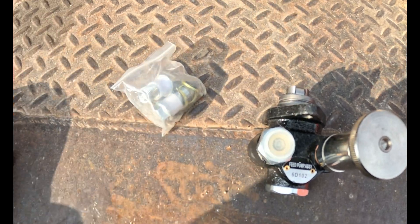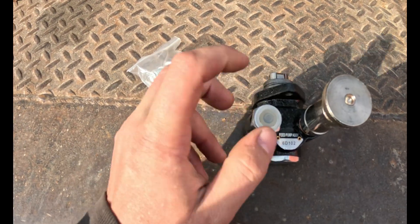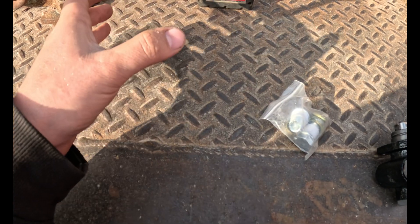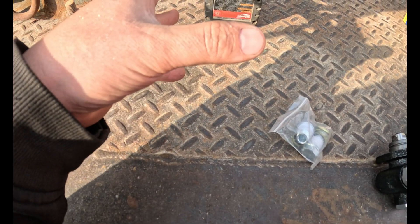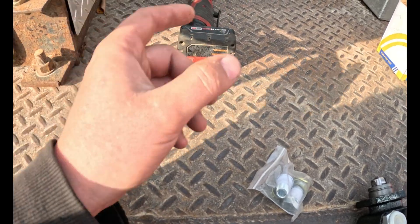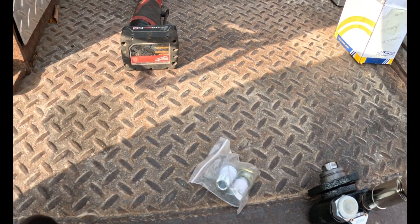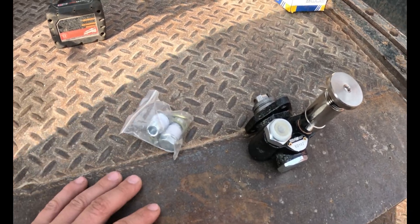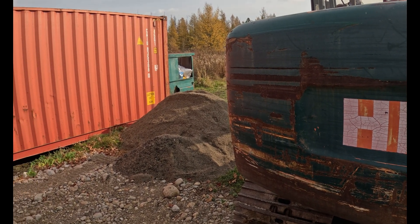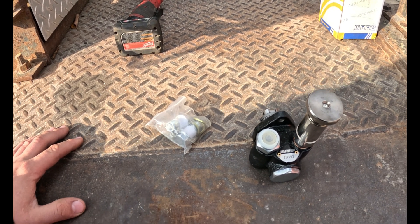When it spins it creates a prime. This is a mechanically injected motor so it has a delivery pump that supplies fuel to a mechanical injection pump. The mechanical injection pump does the timing and shoots fuel off when it's supposed to, to each corresponding cylinder so everything's in time. It usually rides on a gear on the front — this is pre-electronic injection. This machine's from 1999, but that delivery method has been used for a very long time. It's my preferred kind because it just requires basic hand tools to work on.